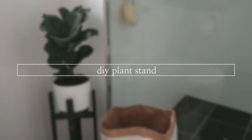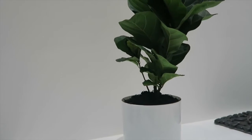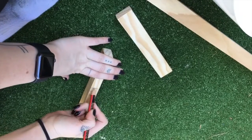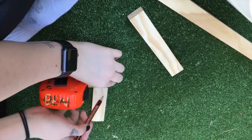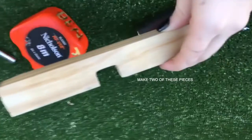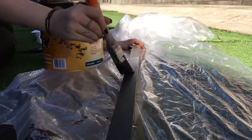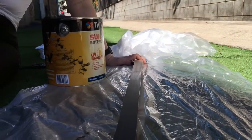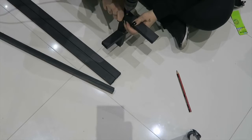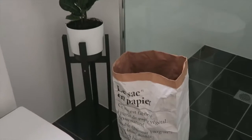I'm also making a DIY plant stand — this is pretty simple. The plant I chose to use was a fig and I'm putting it in a self-watering pot. The middle part that holds up the plant will vary in width depending on what pot you use, but once you have that piece you make a little notch out of the middle — it has to go halfway — and that way you can cross it with the other piece to make a simple cross. Then you need four legs; I used some that are 60 centimeters long. Once you've got the legs sorted, measure where you want the plant to sit on them and then screw it all together, or alternatively use some wood dowels placed into the sides of the wood.